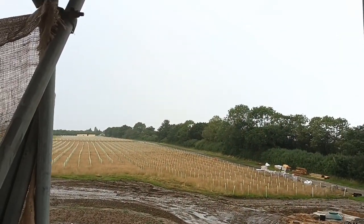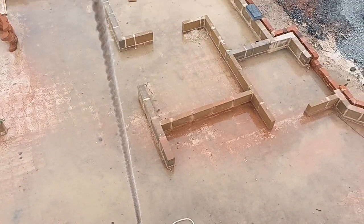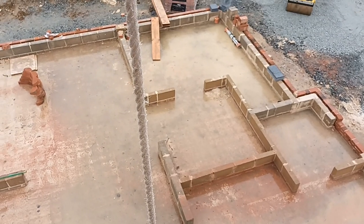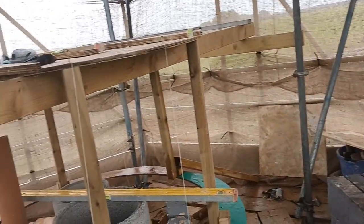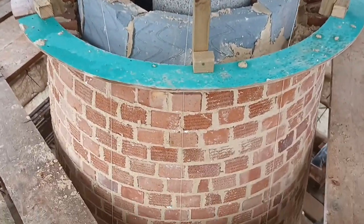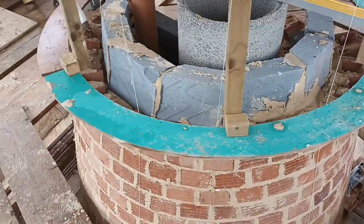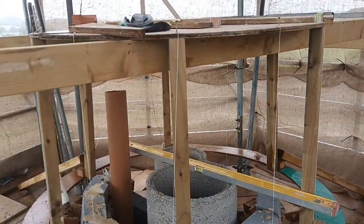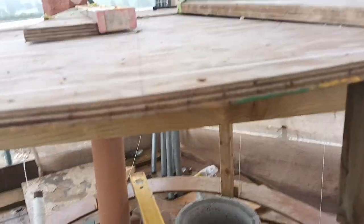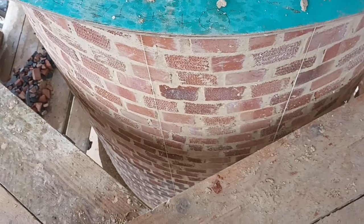It's Saturday morning and we have rain — the oversight is just full of mortar, didn't really leave any holes to brush it out this time. Now finishing off, we've done the taper — same profile as the dodecahedron we did, so everything's the same. Apart from when we used this template last time we had all those nails in here, moving each one round as it twisted. This one is all common work because obviously it's going to get rendered.